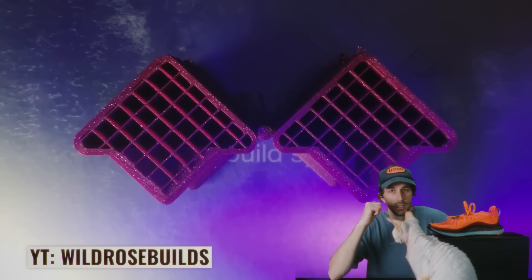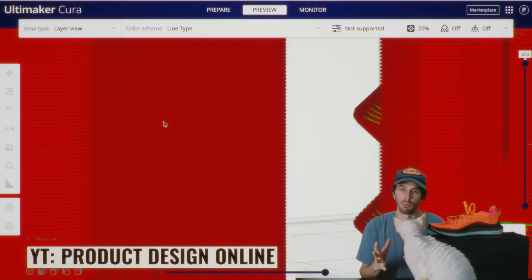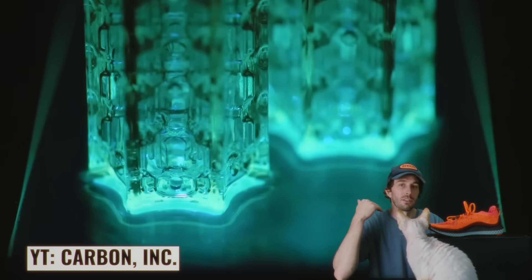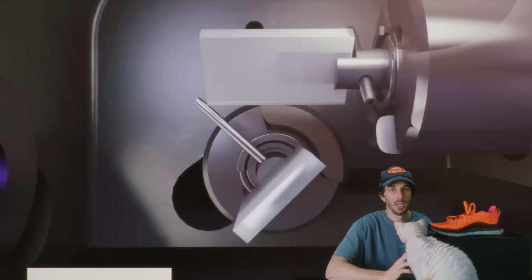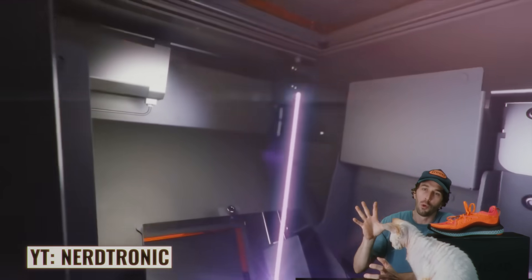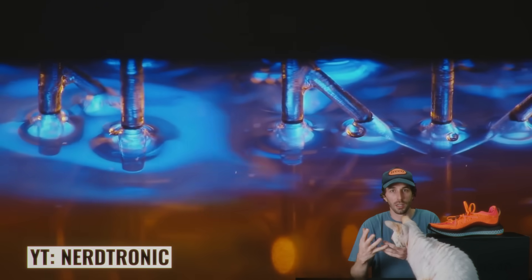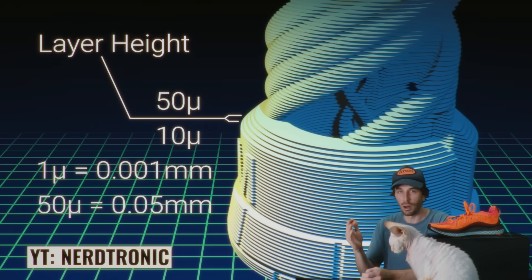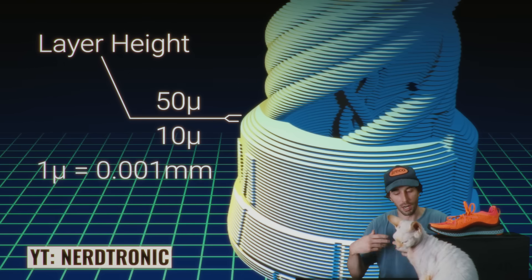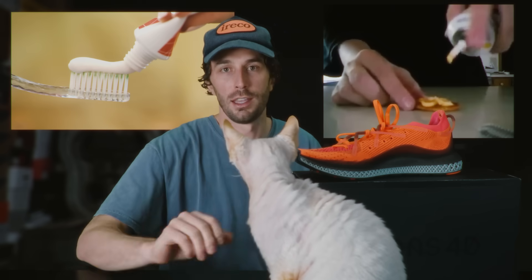It just takes one mistake in temperature, angle, or gravity and the whole thing is ruined. It doesn't have nearly as clean a finish because of all those individual layers. Compare that to digital light synthesis — this stuff is a crazy method. Instead of extruding material, high-intensity light is shot at a pool of liquid resin which cures just the very top or bottom surface of that liquid in the design you're creating. Each layer can be as small as 1/20th of a millimeter, if not smaller, compared to that big sloppy toothpaste extrusion of regular 3D printing.